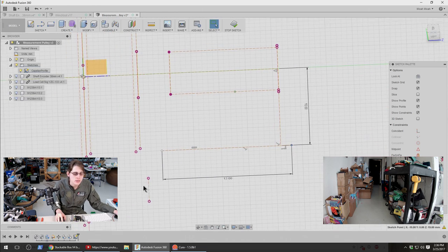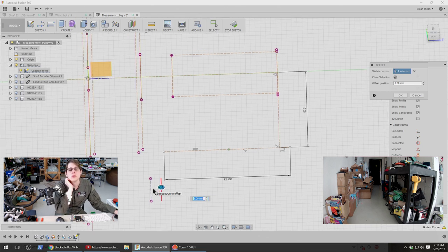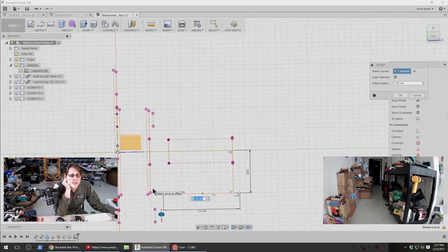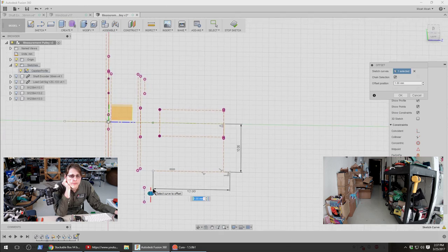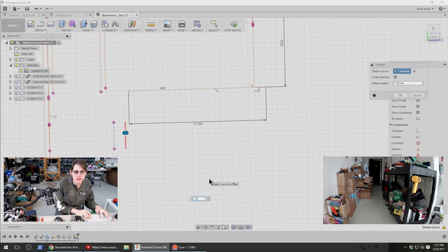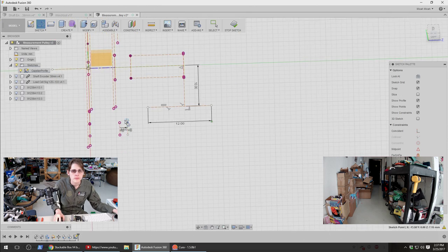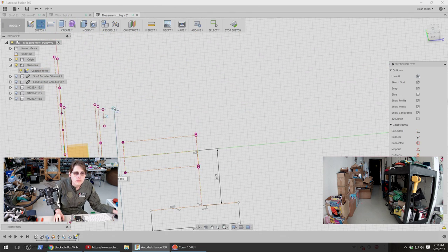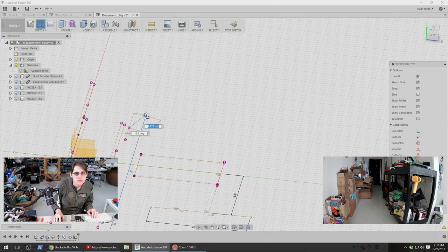See what it looks like if we just give ourselves like a millimeter from this. Mostly I just want this to be enough clearance so that any amount of wobble that we end up developing in this capstan ends up not causing it to scrape against these screws. Let's be kind of conservative here, and let's say maybe 1.5 millimeters. So now this is kind of the limit of what we want to leave room for in the vicinity of the encoder.